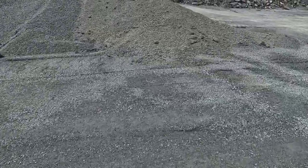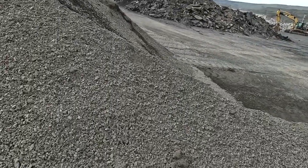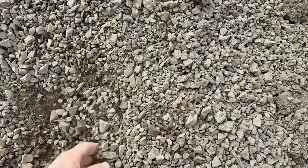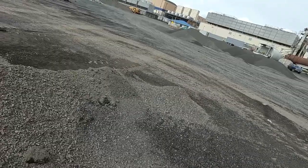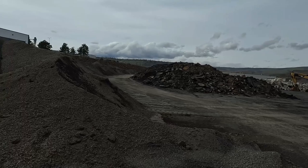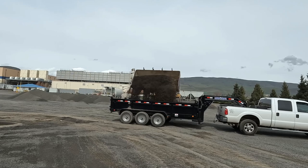I thought it'd be interesting to show you the different types of gravel. This is a pretty small pit — it's an asphalt manufacturing plant. Most of what they do is for the asphalt industry. This stuff here is called the reject — it's like five-eighths minus down to sand. You can see that sand in there. This reject pile goes all the way down there; this is the coarse end, and all the way down there is the fine end — probably between five and six tons right there.